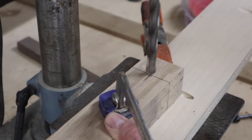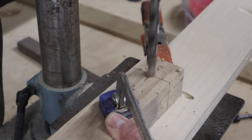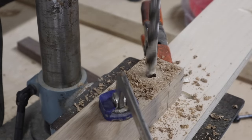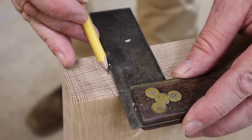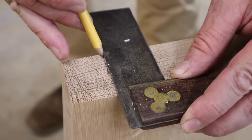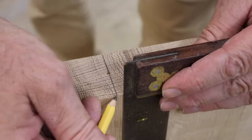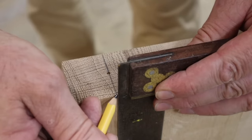I'm using the drill press to make a drill guide that I can clamp onto the base. I'll use a square to draw a line across the center of the pilot hole, and I'll extend that line down the leg on both sides.